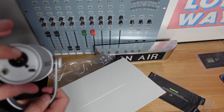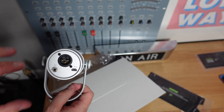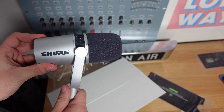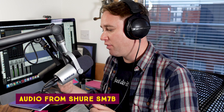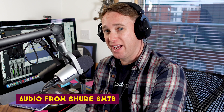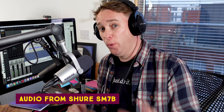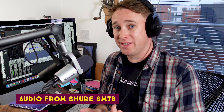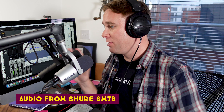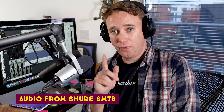I'm going to be testing this using the XLR port today for a fair comparison, and I might throw in a recording via USB as well, but I want to see how this compares to the SM7B. So let's plug it in and find out. I've got both microphones connected to my computer via the Universal Audio Apollo Twin interface, which has sufficient gain to power the SM7B — which is notoriously gain hungry. I've got the gain up to around 60 dB on the SM7B and about 55 dB on the MV7.